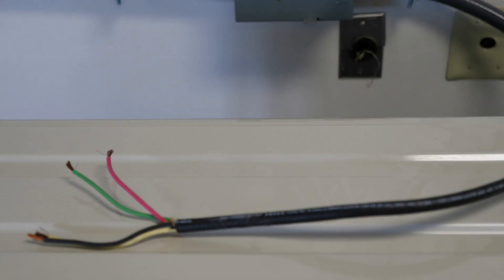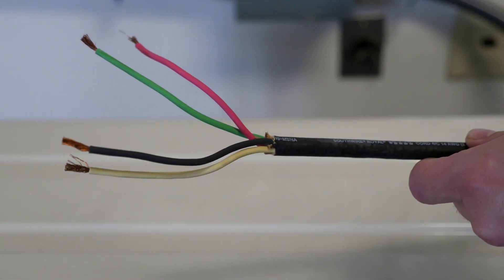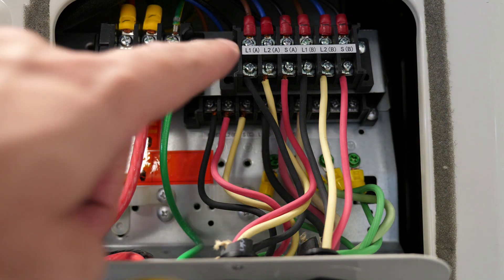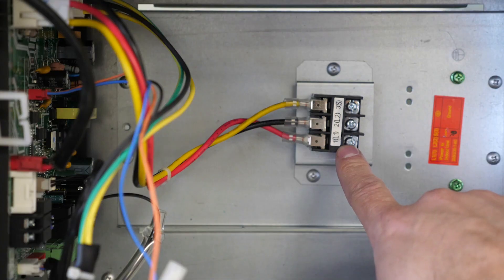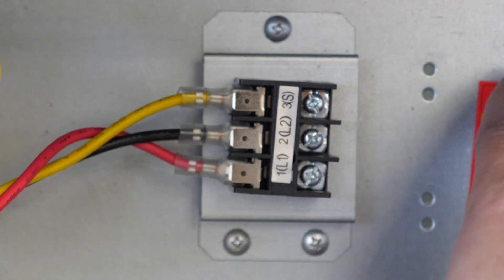The 40 MBAB sizes 18 through 30,000 BTU, as well as the three-ton multi-zone air handler, require 230-volt power and wire to a corresponding outdoor unit using a 14-gauge stranded four-conductor tray cable. This wire is landed on the L1, L2, S, and ground terminals of the indoor and outdoor equipment, providing both communication and power to the indoor equipment.